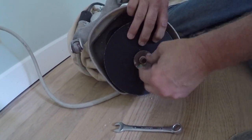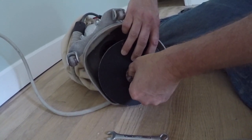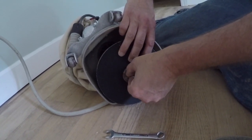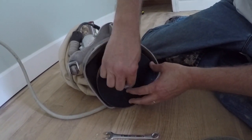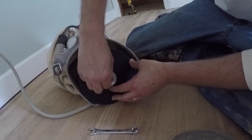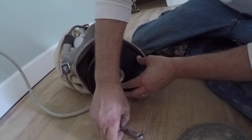The key to this is starting with the least heavy grit — so the higher number — and working your way down. If you find your floors need more taken off than what 100 grit will do, go down to 80 and then to 60. Our floors are in really good shape. We just want the finish off, and 100 grit is more than enough.